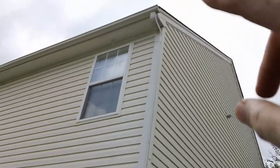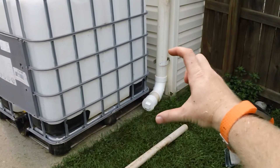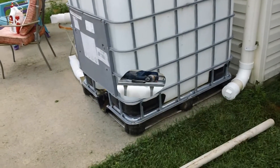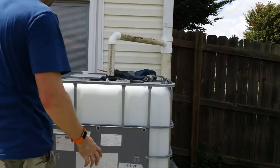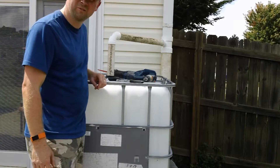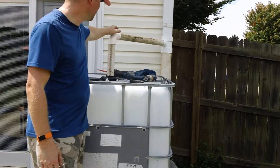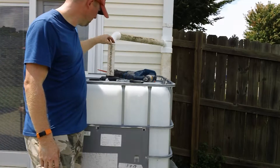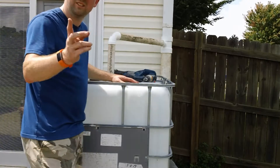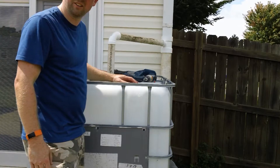So now — from the roof, all the way down, boom — it hits there, comes all the way down. That's hopefully where all the great crap and trash collect, and the water, water, water flows through — cleaner water in there. That, dear friends, is how you very quickly take PVC and turn it into a rainwater diverter: the dirty water is collected down in that 4-inch section and the cleaner water is diverted into this 2-inch pipe here, from the roof to your water container storage — 275 gallons for flushing toilets and water in the garden.